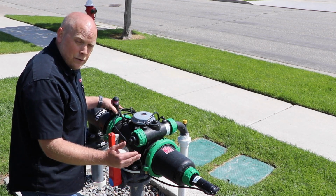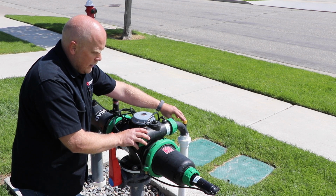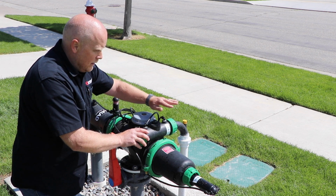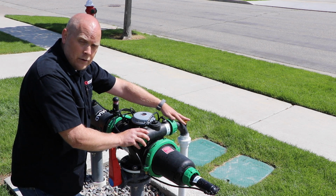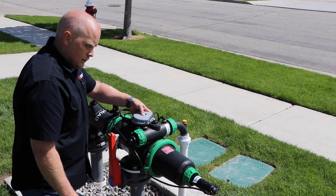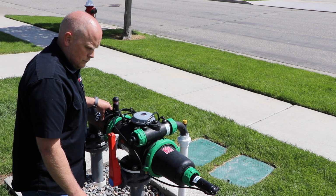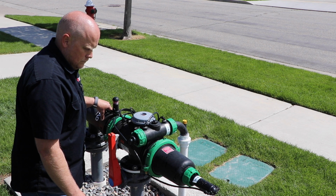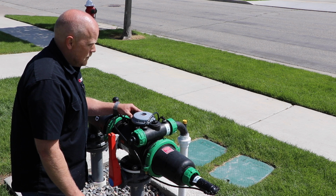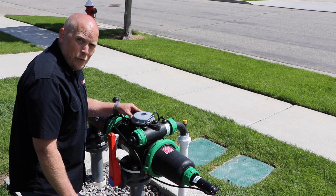It's about a 10-second cycle, and when it's finished its cycle, this air vacuum breaker right here will release the air out of the exhaust line, and as it does so, allows the water to go out, so there's no water hammer. Great feature on the Mini Sigma filter. So we're going to initiate another flush. Just make sure. Now listen to how it sounds. And that's your flush, and it's all ready to go.